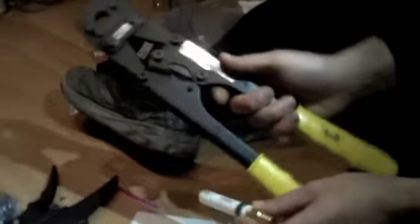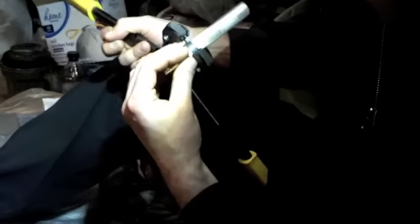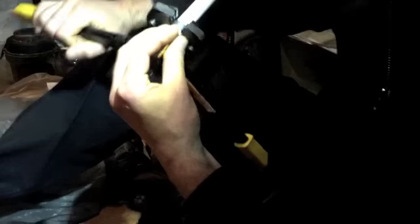we've got the crimp tool here. This is half inch. And just center it on there. Probably a little more particular about this than I should be. But you can see it's got two teeth on each side, and they mesh together and make the crimp. So there it's started. Just clamp down on it. And there it is. It will not come out.